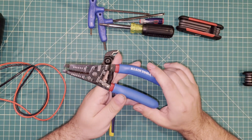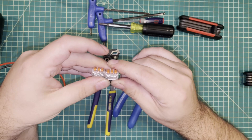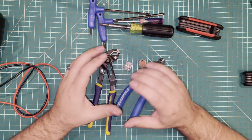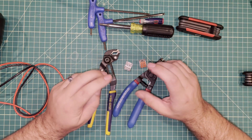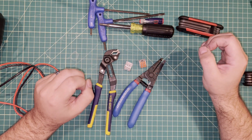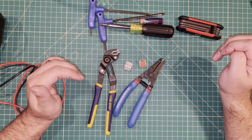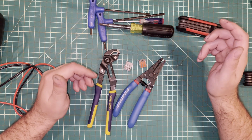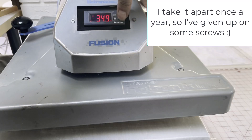If you start replacing parts, you'll need a wire stripper. I used these Wago triple connectors — you'll need two of them if you decide to replace all your electronics, which we'll get into later. You'll also want wide Kapton tape for insulation — good time to make sure everything is properly insulated. Last but not least, if you take the machine apart and the insulation is crumbly or ripped, replace it. Also replace any grease on moving parts with red grease, since it's really difficult to do once the machine is together.